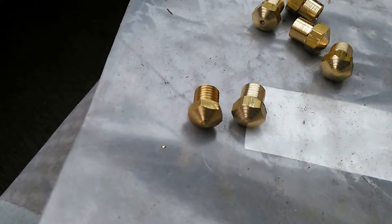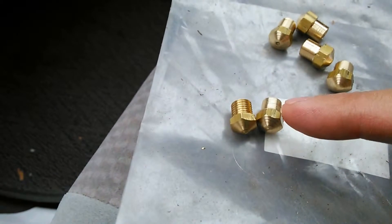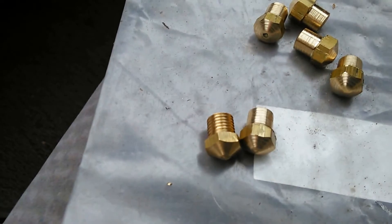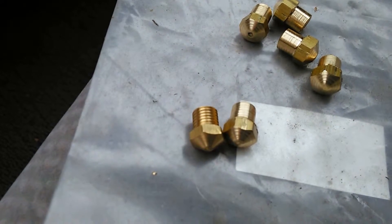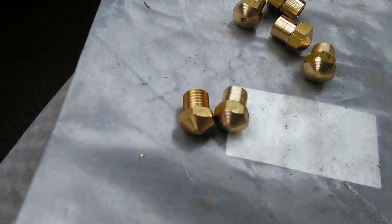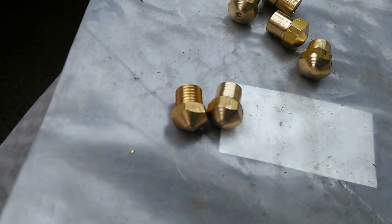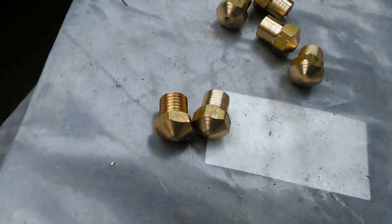You can see the difference - at the bottom where the shank is, it looks like it's threaded but it's not. It's just the way the tool was chattering across the axis. You have to run lubricant when cutting pieces to keep the tool moving smoothly across the face. I was running lubricant, but the tool was pretty dull. I was in a rush and probably should have stopped and sharpened the tool first, but I was under deadline and didn't have the proper equipment.